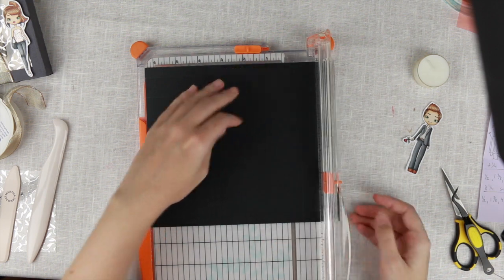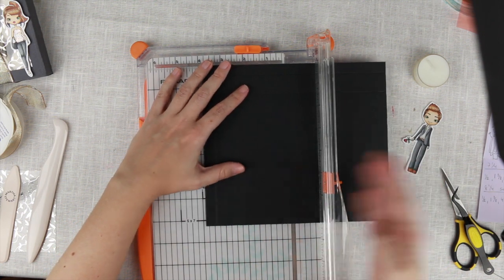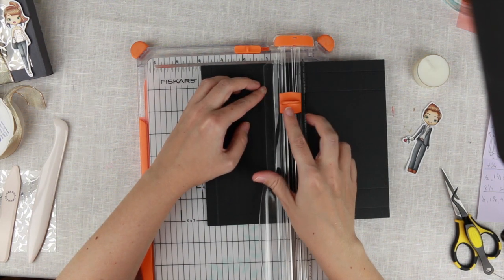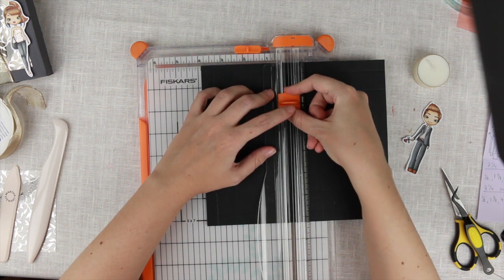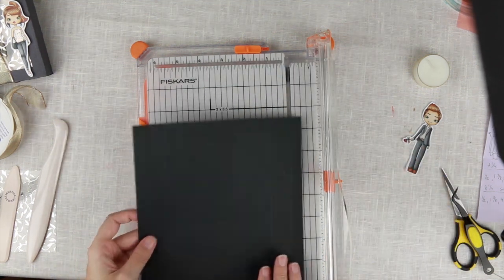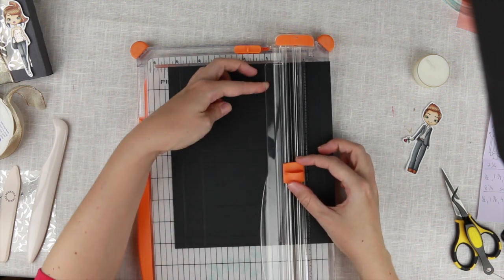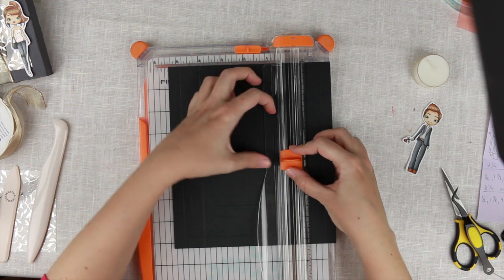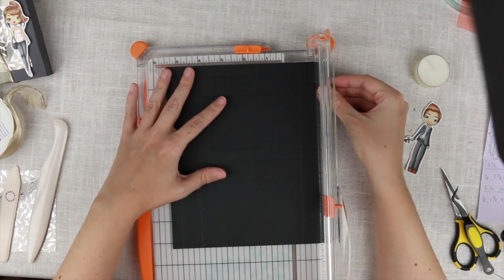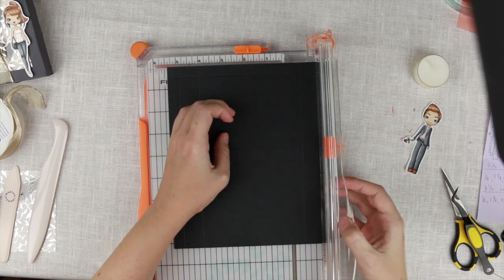You have the lines marked so this is straightforward. Turning it around, we're putting the second score line from the other side at the two-inch mark, and again going from one and seven-eighths to five and three-eighths. Then turning it again, putting the second score line at the half-inch mark. I can line up with the first lines I already scored down. Then I do the same thing on the other side — line the second score line at half an inch and line everything up. That's how you cut the hole in your box.